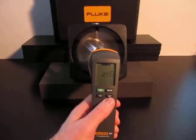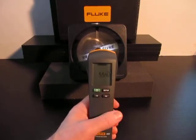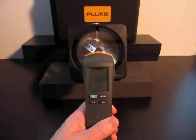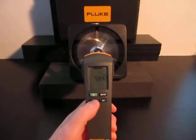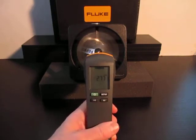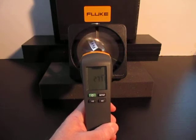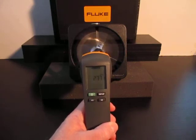If we want to make sure that's not a multiple, we hit the times two button, but when we go to times two, we see two markings on there. That's not right, so let's hit the divided by two to get back to the original speed. That's the correct speed, not a multiple — that is the speed of the fan: 2771.